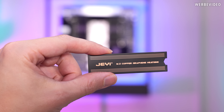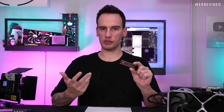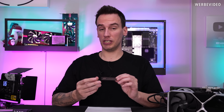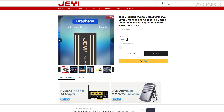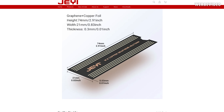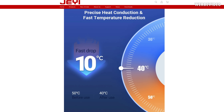We will continue with this — I don't even want to call it a heatsink — this kind of foil. There's a lot of advertising around these foils right now, not only on AliExpress but also applied to many SSDs sold by normal vendors, and they always claim it decreases temperature. On the vendor GE's website we find a lot of information: the first product picture says this heatsink is 0.15 mm tall, scroll down and it says 0.3 mm, keep scrolling and it's 0.03 mm. So GE is probably not quite sure what they're selling, but they are sure it can reduce temperature by 10 degrees Celsius quickly.